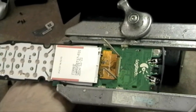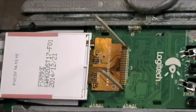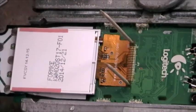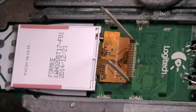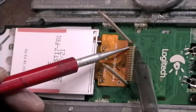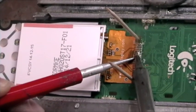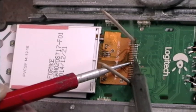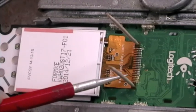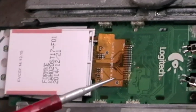I'm going to put on the fume extractor so it will be a little louder. I use this solder helper tool just to press down onto the leads as I solder. I'm going to do probably two leads at a time. We shouldn't get any bridging because of the flux, and if we do we'll simply swipe again to remove any solder bridges. I'm going to clean my bit a couple of times and remove the toothpicks since we don't need them anymore.